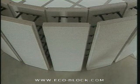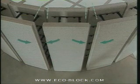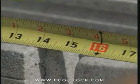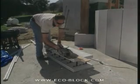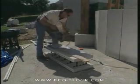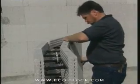To make the form tight we'll be cutting the blocks on the inside of the radius to close the gaps. Measure the gap and cut one-fourth of that amount from both edges of the panel. When you reset the blocks back on the radius they'll push right together on the line.